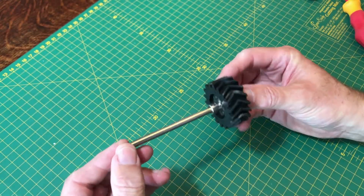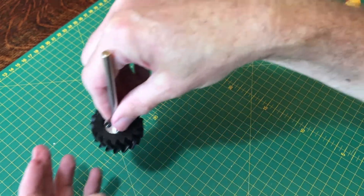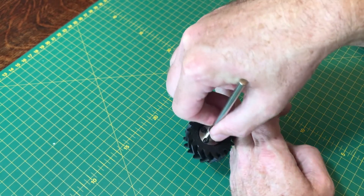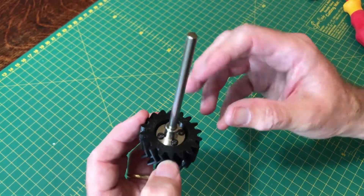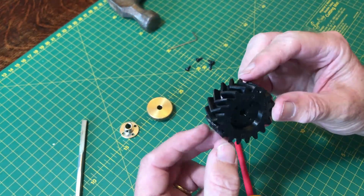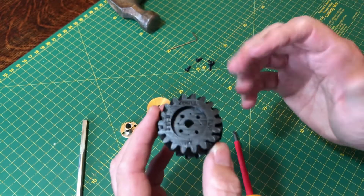We're going to build a drive wheel that will sit within the telescope, driven by a motor to turn the telescope left and right by running against an interior set of teeth in the telescope body itself. We've got to build this first because it's going to be fitted inside the main base of the telescope. This is the azimuth control — the thing that drives the telescope left and right when you're trying to find a target.